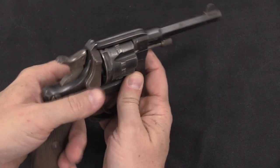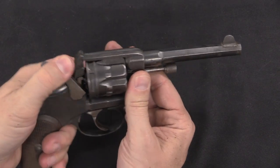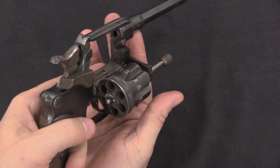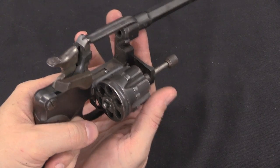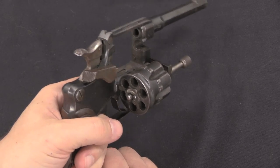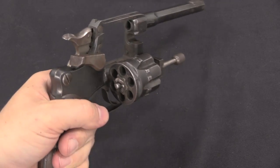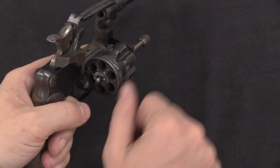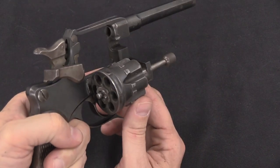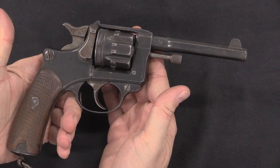Basic functioning of the Model 1892: this is a double action gun, or single action if you prefer. For loading, you take this loading gate, pull it back, and the whole cylinder pops out to the right — the opposite of what is more typically seen. The idea is that the soldier would have a saber for his right hand, the pistol in his left, and reloading would be done holding the gun in the left hand. There is a star ejector here that kicks all the cases out simultaneously. Pop the cylinder back up, lock it in place, and it's ready to go.